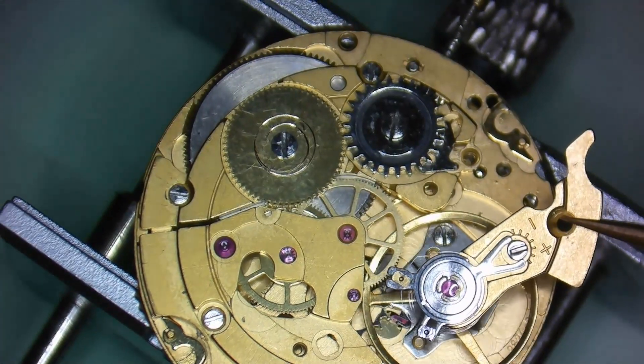What about magnetism actually slowing down a rate? In 40 years, I've never seen or heard a convincing reason how this can actually happen. A movement with a very slow rate could have some magnetism in it, but the fault actually causing the rate to be slow is just more powerful than whatever effect the magnetism is having on the movement.